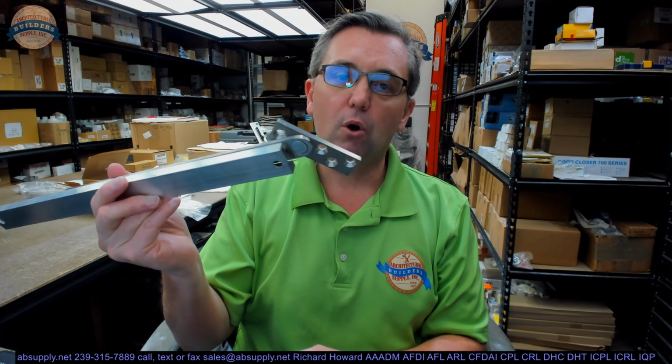Crash chains are really for storm doors, in my opinion. And they do make heavy crash chains that people are led to believe are okay for those applications, but those sheet metal screws will pull out. You put a commercial grade overhead surface or concealed door stop on there, door control on there, problem solved. And that's what really those are for, that entire gamut.